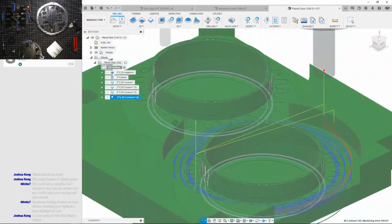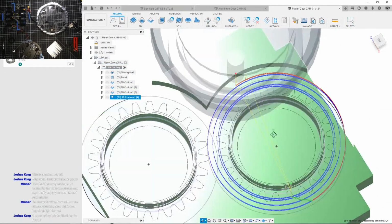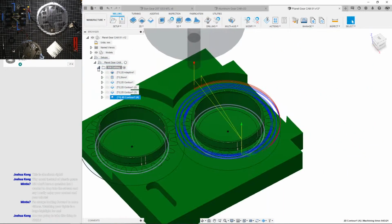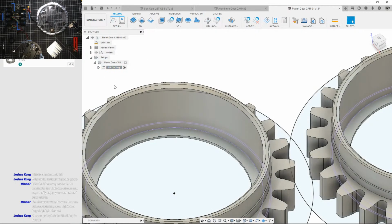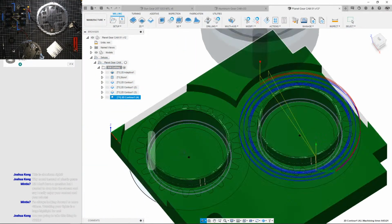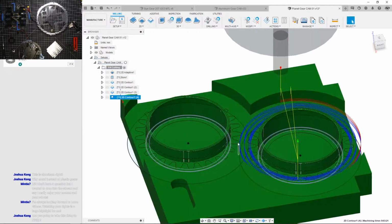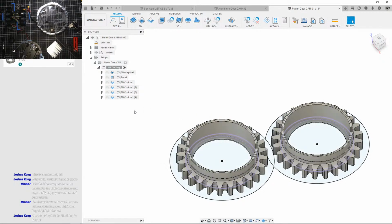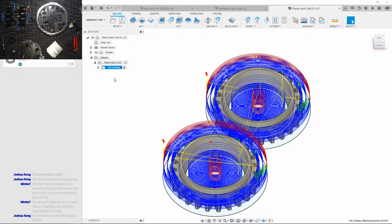Okay, we're getting close to the contour section for the gear part. So that's a good thing. So that should be most of the stuff. If I go down here, I haven't cut through the material yet, and that's because I need more surface area to hold down the part while I'm cutting it, so I'll cut that inner circle out later.